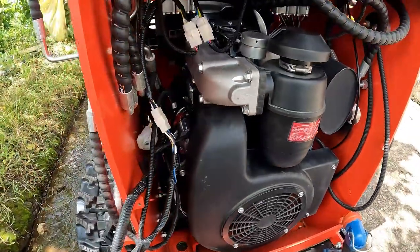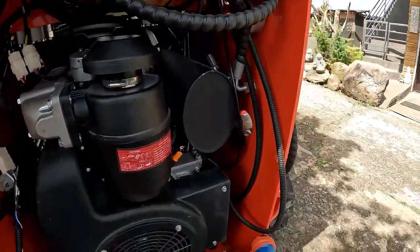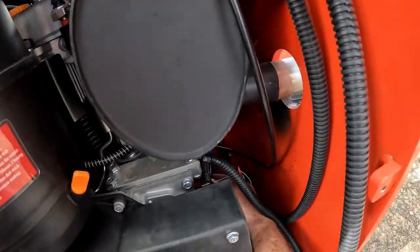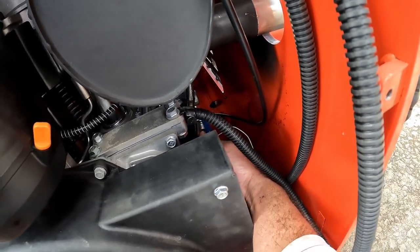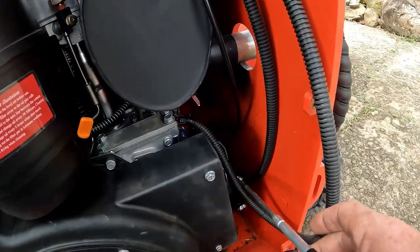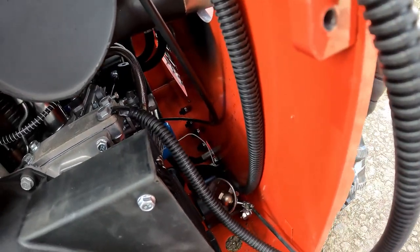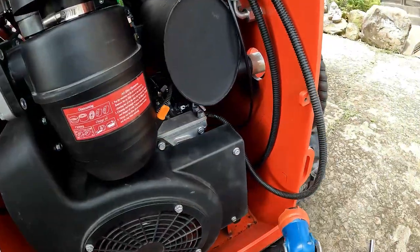I'll show you a little bit about the inside of the back cover. It's actually a little tighter to work with than the excavator. The first thing I'll show you is where the engine oil dipstick is — way back and under here where my hand is. You can't really see it, you can feel it or use an inspection mirror to take a look. It's even difficult to find with a mirror, but it's down there — just a short little dipstick.